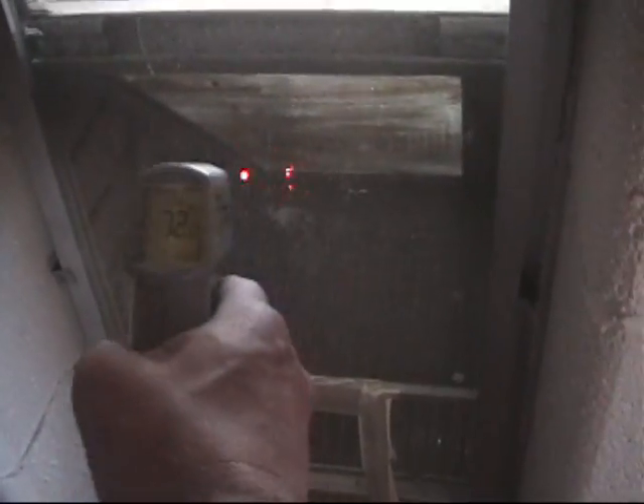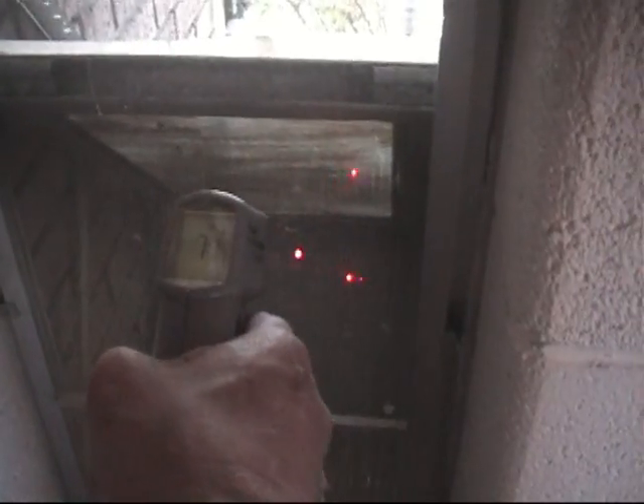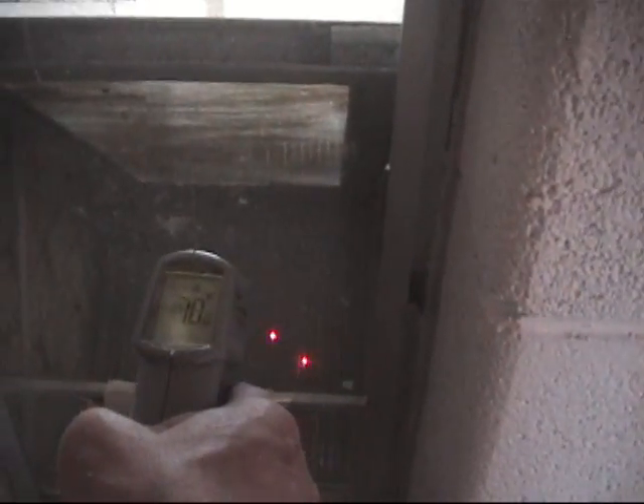This also reads out temperature — it says 80 right now; I hope it drops down. There's another device that gives us some sense of the temperature of the coil and the water in the coil. Right now, even though the well water should be below 60, we haven't cooled down the pipes and the coil all that much. We're at between — and it varies across the coil — 68 on that side, 71 on this side for that particular coil.